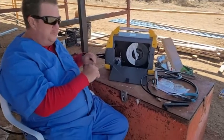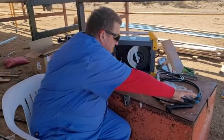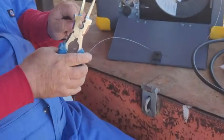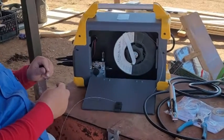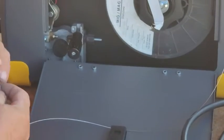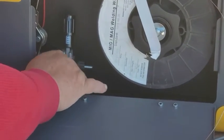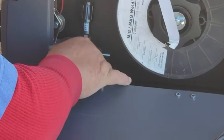We pulled the roll back out. Very handy — a $12 welding tool is good for your tip. You take it inside your big tip and clean things out. We're going to cut the little end off. Right now they're calling .035 number 9 and .030 number 8, so we have to switch this roll over to number 8.